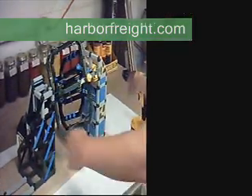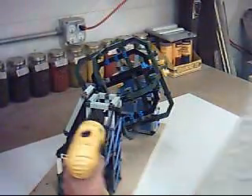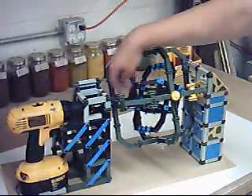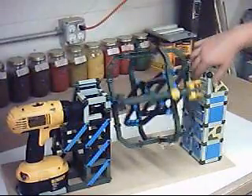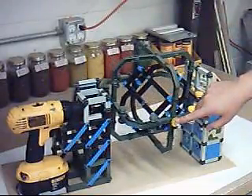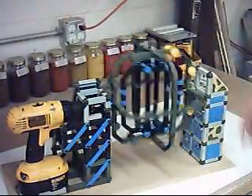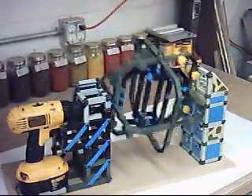You can see I've basically built a mounting cradle for the DeWalt drill here. It just slips in and slides onto a rail that's glued into one of the connection pieces that spins this. On the other side we have another connection piece that's glued down, and then a set of bands that runs to a third rail. So as this spins in one direction, the inner piece spins in a one-to-one ratio as well, which gives us that full range of motion to do rotational molding.